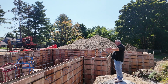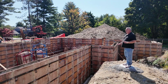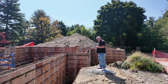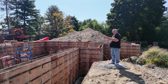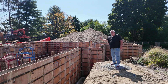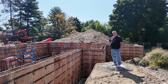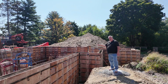And then here, this middle section and this little wing behind me — we're going to have a little connector piece that connects those. That's a standard basement, going to be your standard nine-foot tall wall. The difference between the nine and the 11-foot wall is simply that two feet. The nine-foot wall typically will have a bar mid-height, a couple bars at the top. This is going to have a braced floor frame on it, so as we backfill this foundation wall it's going to have a tendency to want to push in, but the floor frame is going to resist that push back. We're going to use that floor diaphragm as the hold back for this as a retaining wall. If there was no floor frame, then this would have to be installed as a retaining wall because there would be that constant push to try and overturn this wall.